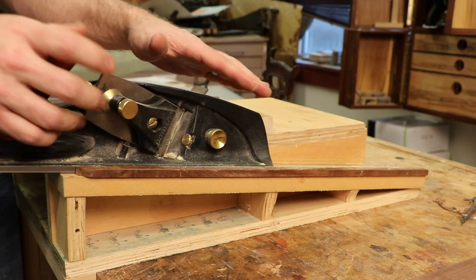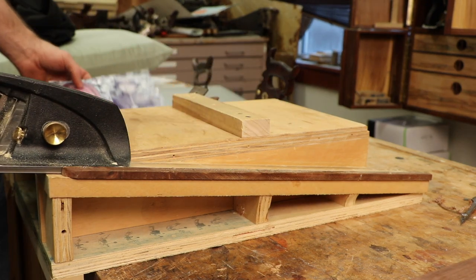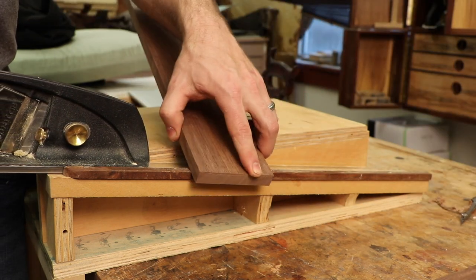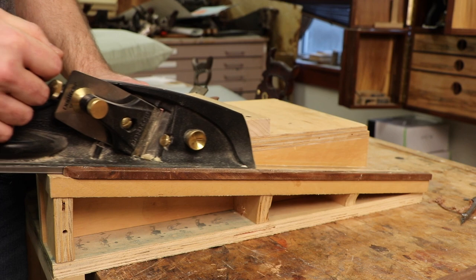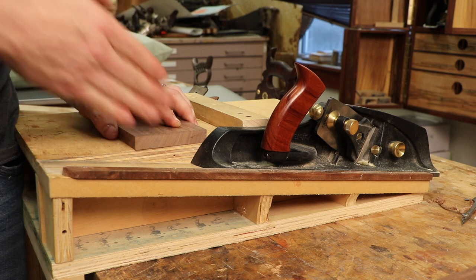And it was about angled shooting boards. And I bought all in and made myself a little mini angled shooting board. The way that this works is that we will saw our lumber or a board here to the right size, very close to my line. And then I will sit like this, and this hand plane runs along and cuts the end grain. And because of the ramp, it acts as a shearing cut.